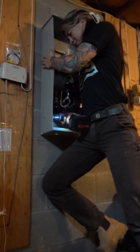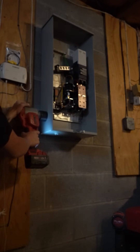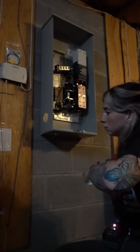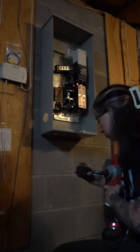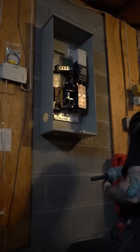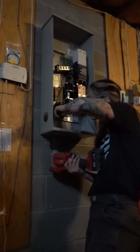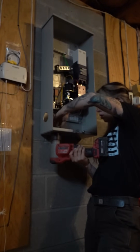I'm bringing new SEU cable in from the junction box into this transfer switch for my utility source connections. I'm using the Milwaukee automatic knockout set to knock out these holes — two 2-inch knockouts on the side. One 2-inch is for the SEU main service cable, and the other is for a 2-inch SER cable going from the transfer switch into the panel where the main breaker is. I'm also making an inch-and-a-half hole at the bottom of the transfer switch for the wire running to the actual generator.